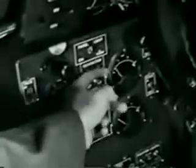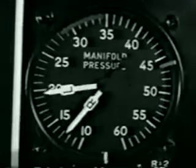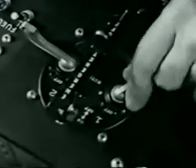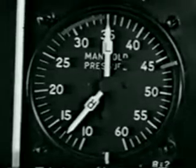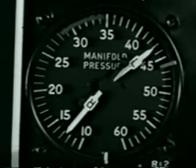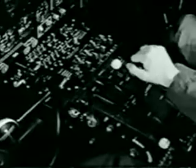28 and a half on each. Generators checked and off. Check mags at 28 inches, starting with number one. While you're boosting manifold pressure, remember there's a backfire hazard during the mag check, so you check turbos off — waste gates open, just to be sure. Both, left — don't watch the tach, watch the engine. Roughness doesn't always give you a quick drop in RPM. Both, right, both. Throttle up to the stop. A quick check of manifold pressure, then full turbo. Since you're using 91-grade fuel, you can't draw 46 inches — power's cut about 10%. Set your lock, check RPM — a little below 2,500 on this fuel. Take a look at the engine; everything okay. Back slowly on the throttle because of the induction backfire hazard. Same procedure on all engines.